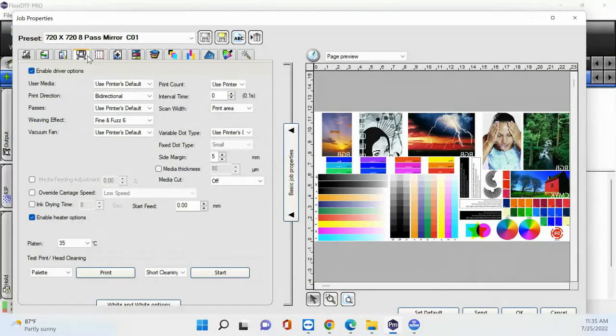We'll go to the next tab. There are two ways you can print: the printing industry prints bidirectional or unidirectional. When you print bidirectional, the carriage moves from right to left printing, and left to right printing as well. So it's jetting both ways. If I change it to unidirectional, it will give sharper edges, but it will print in only one direction, which means the machine will slow down to half the speed. We always print unidirectional, and the quality of our STS 62AD is fantastic.